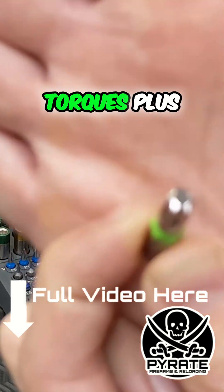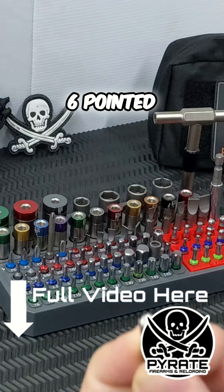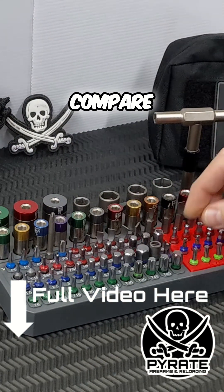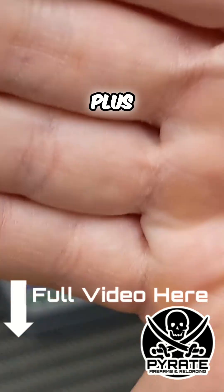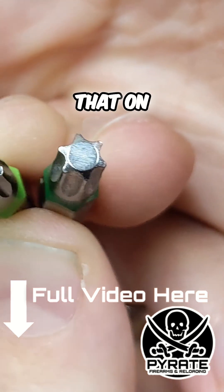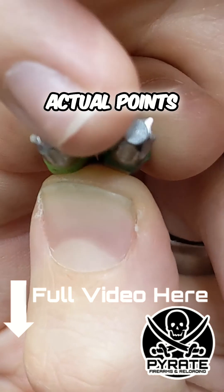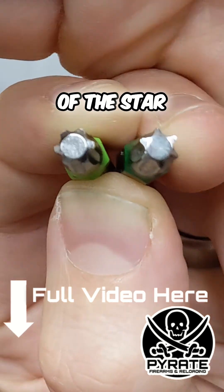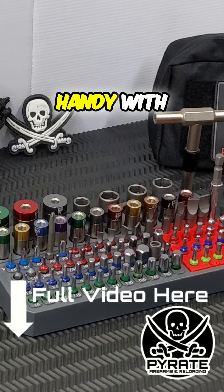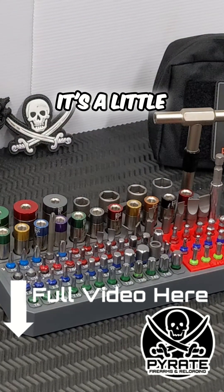You may not know much about Torx Plus — it is the same six-pointed Torx bit you're used to. Let me get one to compare. This is a T30 and a T30 Plus. If this camera focuses, you'll notice that on the Torx Plus bits the actual points of the star are fatter than the standard Torx. That comes in really handy with bigger fasteners, or if somebody's monkeyed around with a fastener in the past and it's a little bit stripped.